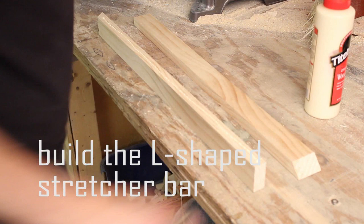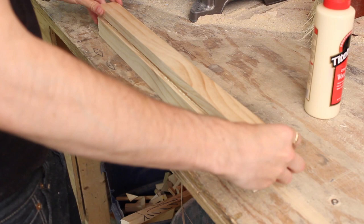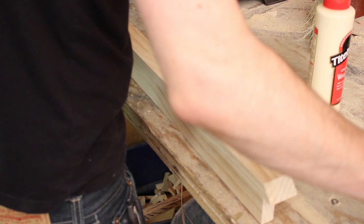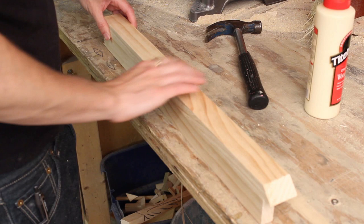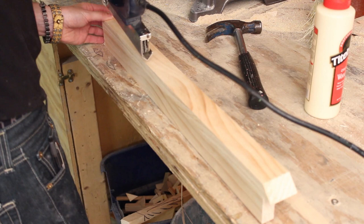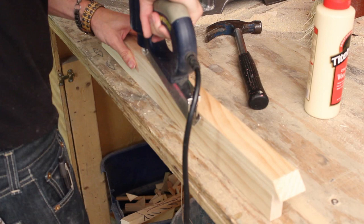Get some hearing protection since we're going to be using a staple gun. Once you're here, place the second 1x2 on top and get it lined up nicely. If you don't have a nail gun, that's fine — with traditional nails, just start a couple of nails down the length before you put this on top. I've got an electric nail gun; they're not too expensive, though you kind of have to pound out and finish the nails by hand. Of course, adhere to all safety rules and common sense — protect your eyes, ears, and breathing, and don't nail through your hand.